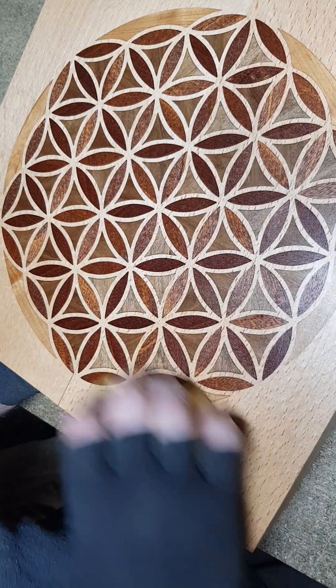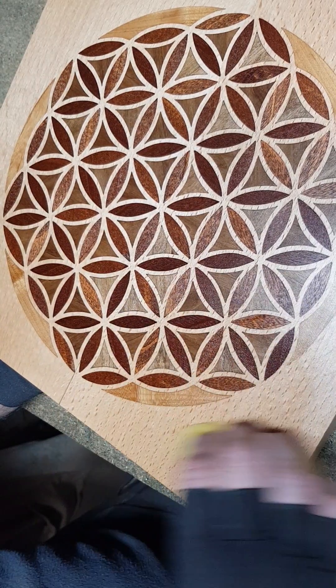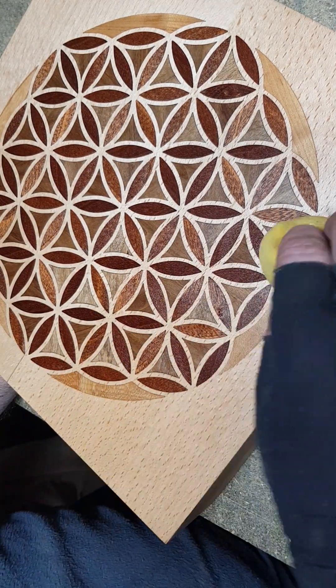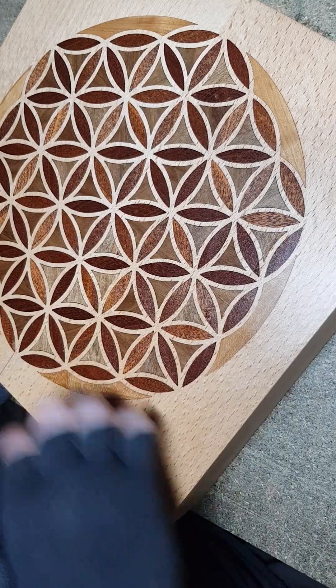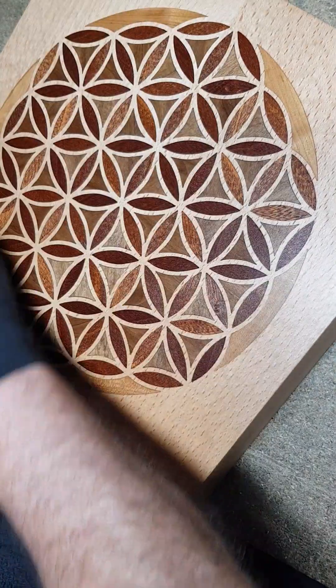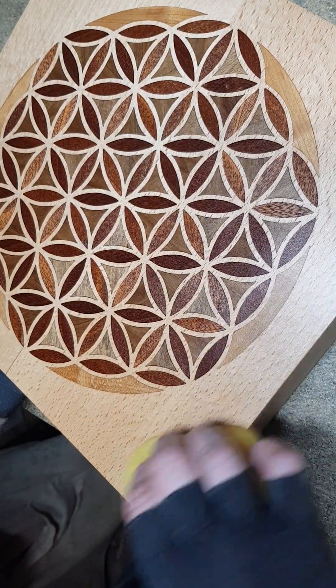Once you've got a coat — this is the third coat going on now — and I'm working it all the time. The more coats you put on, you've got all the different grains in the wood and they will take in a little bit of oil each time. It eventually becomes flat, nice and shiny. I've used 15 coats before now on a piece — on a little owl I did — and it came up like gloss. But you have to rub it down between each coat to get it like that.